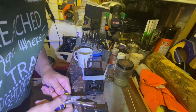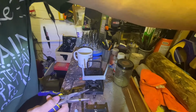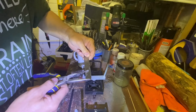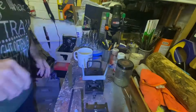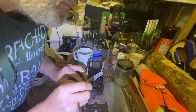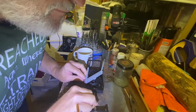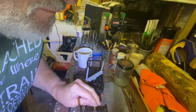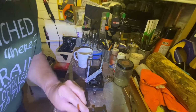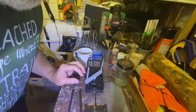Now I know how far apart the two bolsters must be, measuring it with the trusty old slightly stiff pliers, and I now need to find something to make that new bar. And the perfect piece of material comes to light in the bits box, which is some 2mm internal diameter copper tube. I'm going to bend this at right angles at each end, in the correct place, and then I'll flame it to give it some aging.